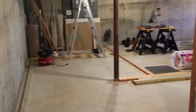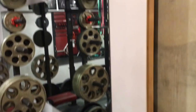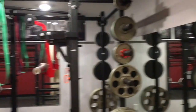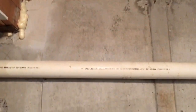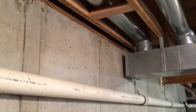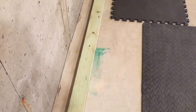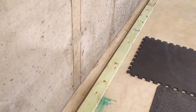Today's January 15th, 2017, and I'm gonna start phase two of finishing my basement. If you've seen my other videos, I finished off half of it about two years ago to make my home gym - this whole area, all cleaned up, painted sheetrock. For prep work, I put these cross members in between the joists so I have something for a wall to attach to. I dropped a plumb line to see where I'd clear the drain pipe, then put some floor plates in with a little adhesive on the bottom, lined up with my chalk line.